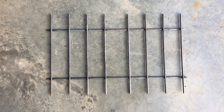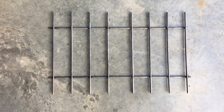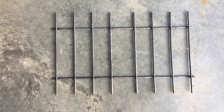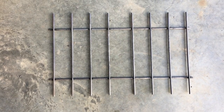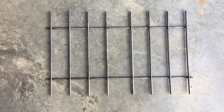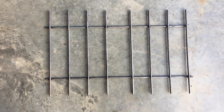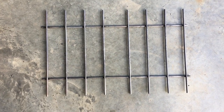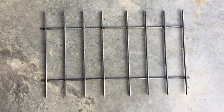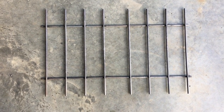This is why I love the e-tank. Here's our grate — all I did was hose it down and give it a little rub with some steel wool. Really no elbow grease, just a wipe down. It could polish up a little more with more steel wool, but you can see even the plating is still in good shape on much of this. You can put a whole stove body in there — it'll take the rust off just like this and strip the paint as well if you need to. Lantern founts, cast iron, old tools — so that's the e-tank. I hope you enjoyed and found it helpful. See you next time.